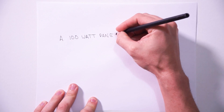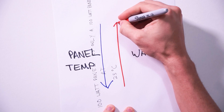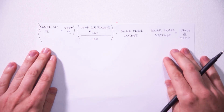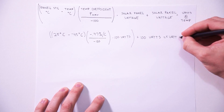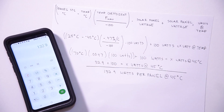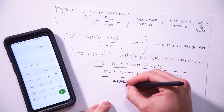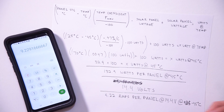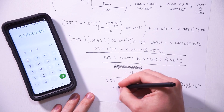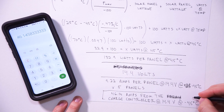Could that mean lower temperatures can affect the max amp output as well? Absolutely. A 100-watt panel is only a 100-watt panel at its standard testing condition temperature of 25 degrees Celsius. As the panel cools off, it can actually generate much more wattage. To find out how much more, we need to use this formula: take the difference of the panel's STC and the estimated low temperature, and multiply that by the result of dividing the temperature coefficient of Pmax by negative 100. We can then take that number and multiply it by the solar panel wattage, and add the solar panel wattage. This tells us how many watts we can expect a panel to produce at that estimated low temperature. Now that we've got our max watts, we divide that number by 14.4 — that tells us how many amps per panel we can expect coming out of the charge controller. Multiplying that by the number of panels in the array — in our case 5 — gives us the estimated maximum amperage output from the charge controller when we're at that low temperature. It'd be a good idea to keep that number handy.